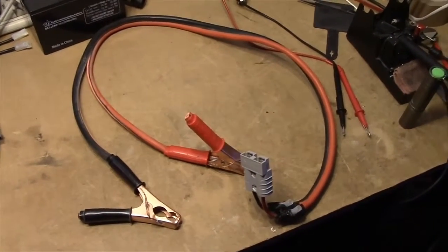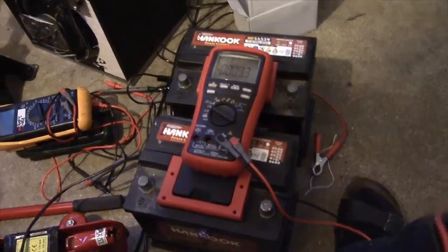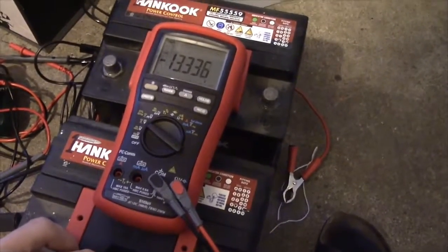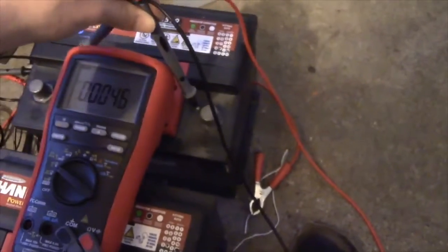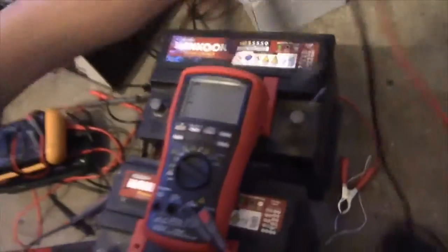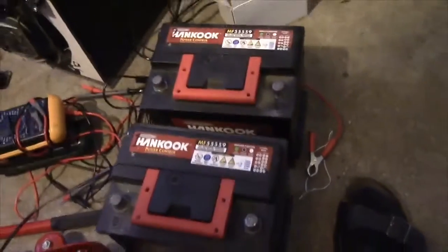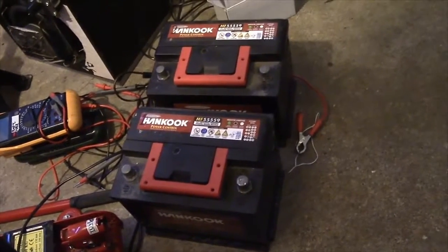I'd call this project a success, although I should have measured it before. So these batteries have gotten to rest for quite a few hours now. Let's see what we've got for OCV — 13.336V in that one, and 13.305V in the other one. That's a result I can be happy with. I don't think we were up in such high voltages before I did this little load thing on them. So now's the time to hook them back up with the new cable and see what kind of runtime we get.